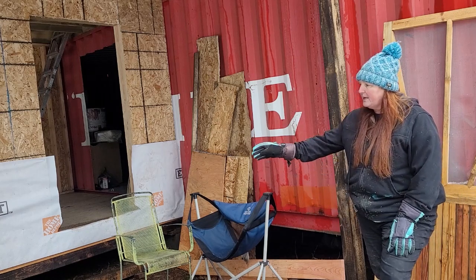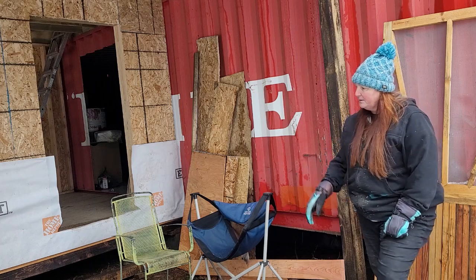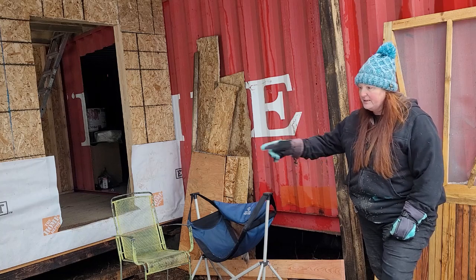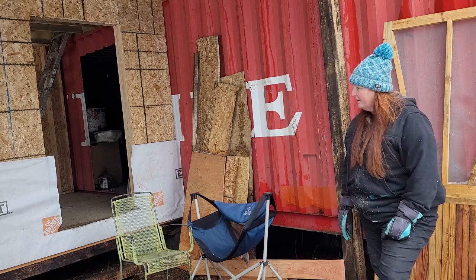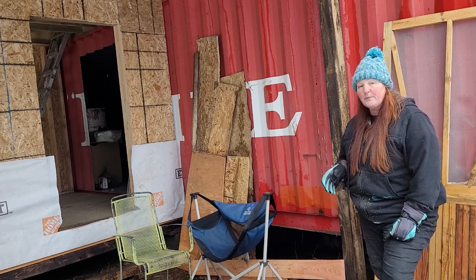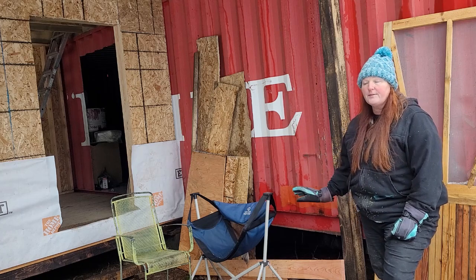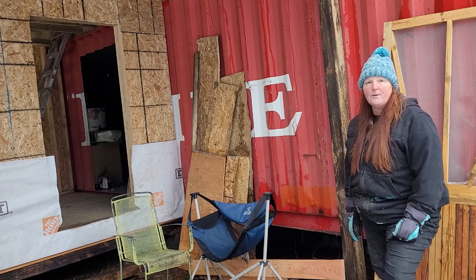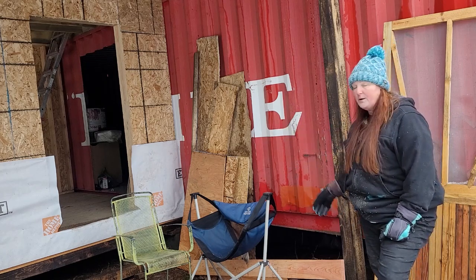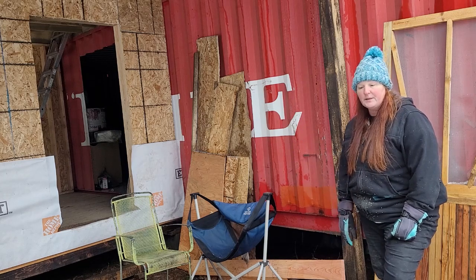This is about a 10-foot this way, east or west, and I think it's 8.5 feet, 9 feet north-south. So I'm pretty sure out of all of the lumber that we have just kind of hanging around that did not get used earlier, we have enough to frame this in, and then we can come back with 1x material and add that at least over this walkway for now. If that's all the 1x material that we can find.